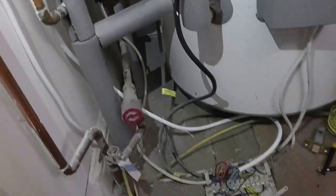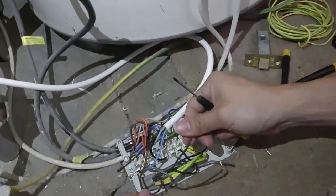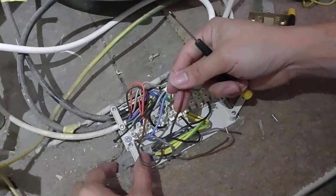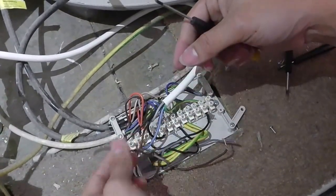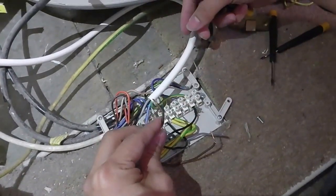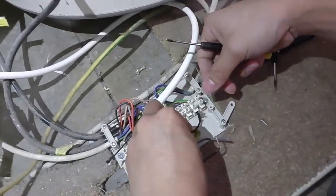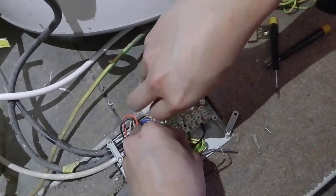Let's go through the main wires of this part. As explained before, I have labeled the main wires that go to the device. You need to ensure that the live wire is not used at all, because you are just using the 12-volt supply, so we can simply secure it and take it off, or put it into an empty slot, which is what I'm going to do.